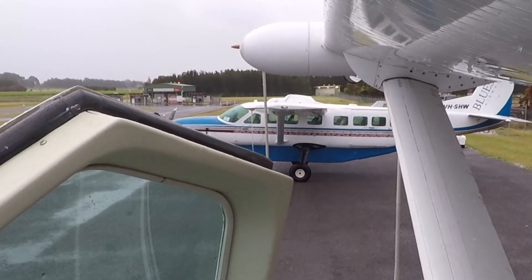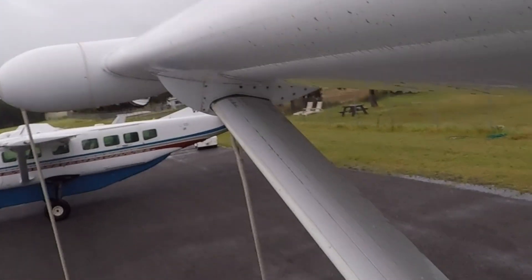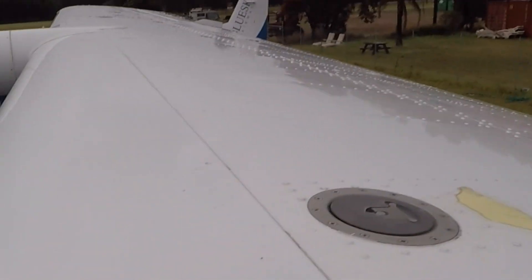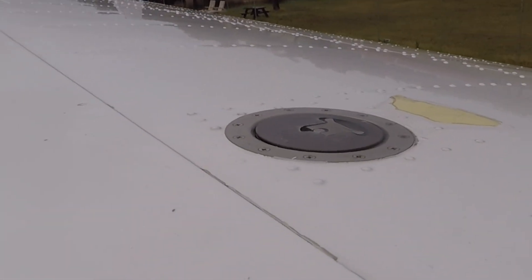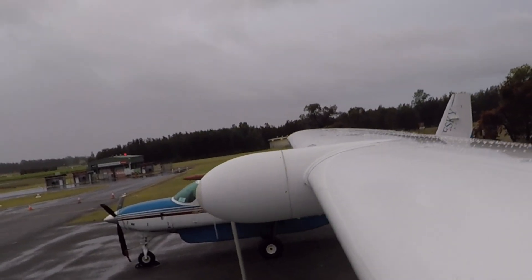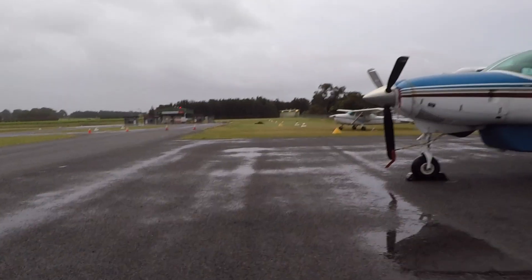Whereas refueling the one without single-point refueling, it's a long way up onto the wing. This one has inboard and outboard fuel fillers, so if we have more fuel than the height of the inboard filler and we open that filler, fuel will go everywhere — so generally unless I'm only fueling to a very low quantity I'd still use the outboard one. Of course we can't always use single-point refueling because the bowser has to have the equipment too. Thanks a lot for watching; I hope you enjoyed that little comparison between the float caravan and the wheeled caravan. I'll try and get some videos with the floats in action shortly, and prepare them in flight — I'll see you in the next video.